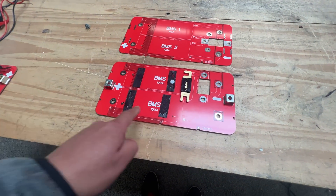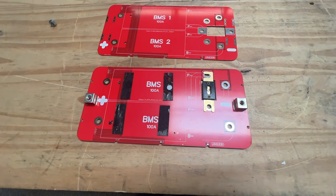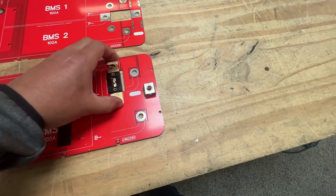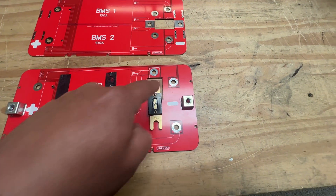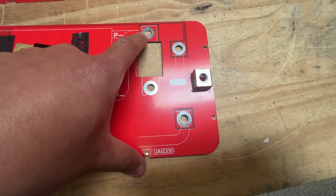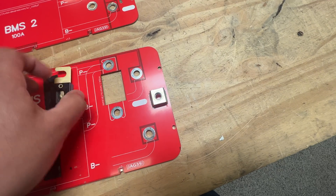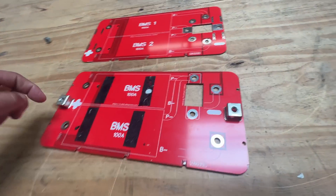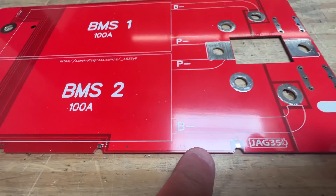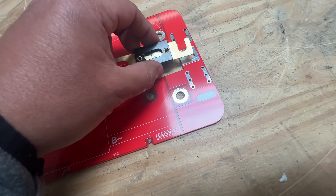Since the last video, I populated version 1.2 but I didn't like how the wires, especially those big wires, had to route going to this one section. It was kind of off center. I figured I could move it more in, but that still caused some routing problems. I also had a mistake where these traces needed to be fully exposed because that's where all the current is going to be going through — 200 amps. So they needed to be more exposed. I redesigned the entire board, and now there's the exposed area that should be able to carry that current.